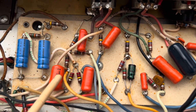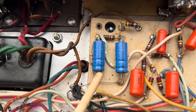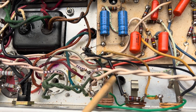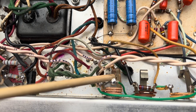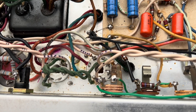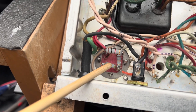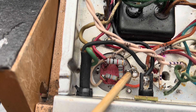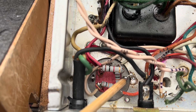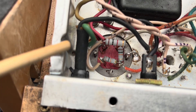No sense having it span all the way across and be unstable when it's perfectly fine to connect here since it's going to ground anyway. Another cleaned-up cap. You have your bias supply here, some nice film caps, and some rewiring. I added a new jack here that's going to switch to ground in the event that you lose your speaker cable from the jack, give you some protection. Here's your new cap can — came out really nice. And this is how I ground it: even though it's being grounded through the chassis on the mounting screws, I add a thick 16-gauge bus wire from the ground tab to a nice chassis solder joint.